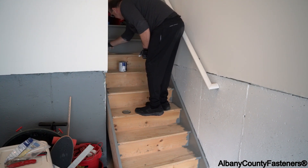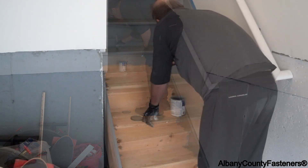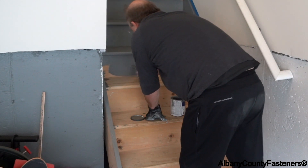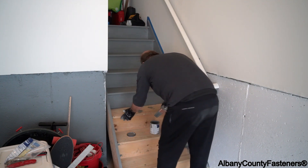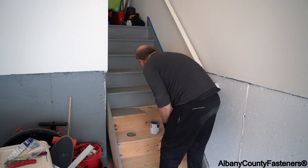These are garage stairs, so you don't have to sand them or make them look so beautiful. I'm going to cover them with carpet eventually, but this will seal them up as a good sealant until then. You can see I'm always cleaning the edge of the can — otherwise the paint builds up on there, so always keep that edge clean. This is going to dry really fast because the wood is just going to absorb the paint; the first coat absorbs very quickly.